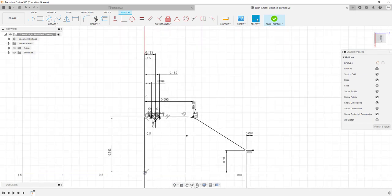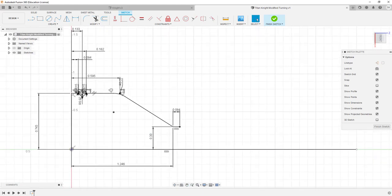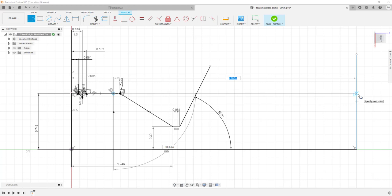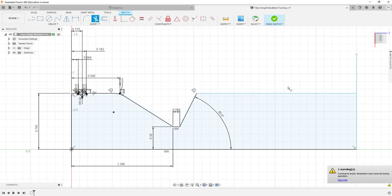So far so good. I like the bottom of it. As we've done on the other ones, we'll extend out the back a half inch — I'll do that later. There's an angle at the bottom of the Knight; I do this angle slightly differently than the Titan demo, and there are a million different ways to do things. I'm going to bring a line up here, connect to a diameter, run it over at 90 degrees so it intersects, then trim out this section.